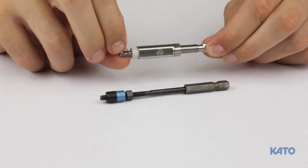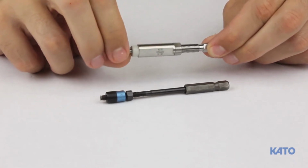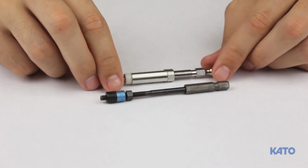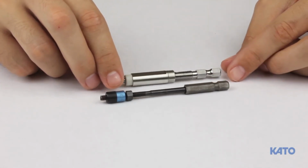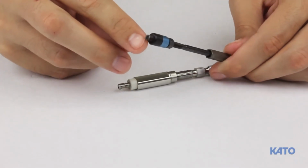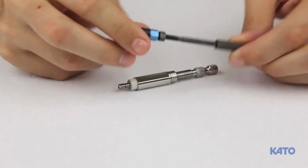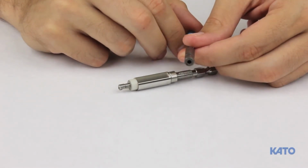Inside the tangless mandrel is the spring-loaded pivoting pawl. This is the part that will grab the insert and drive it into the STI tapped hole. The tang mandrel has a drive contour that will grab hold of the tang and drive the insert in the STI tapped hole. On the back here we have a standard 1/4 inch hex.